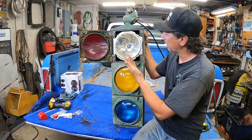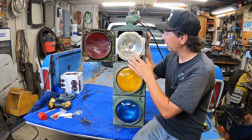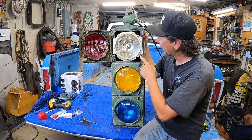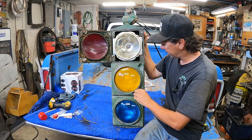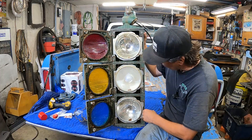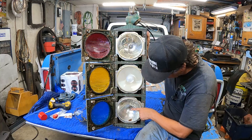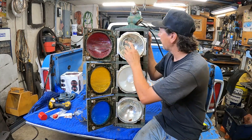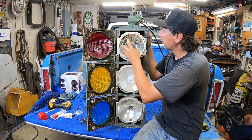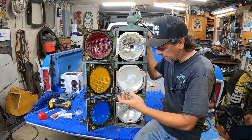The magic of what makes a traffic light work is the reflector. All traffic lights nowadays are LED, but originally they were a chromed reflector and a 120-volt incandescent lamp. I'm not sure of the original wattage — I bought this at a garage sale for $40. It's got a mix of lamps: a 60-watt here, a 25-watt old GE here. The upper lamp might be one of the original heavy-duty rough-service lamps with a five-sided filament.